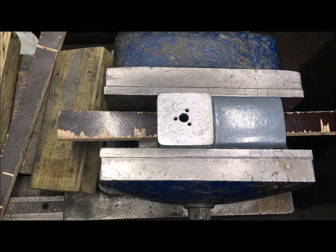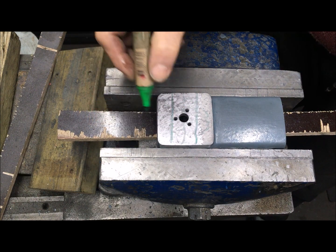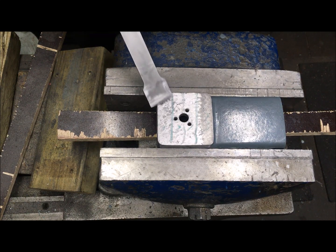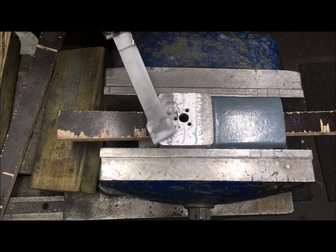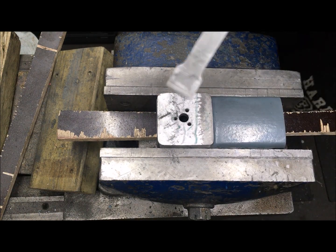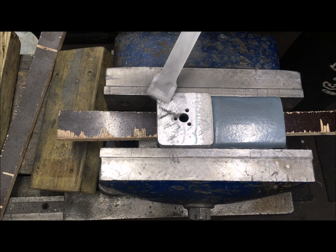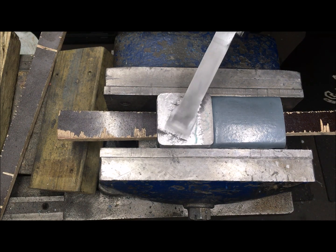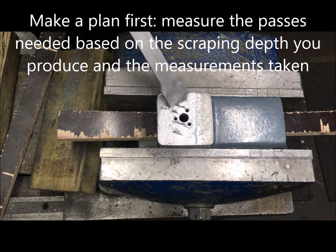Because this was a little bit high here, I'll show again: step scraping — three times, two times, one time. Let's start here; I go in circles with the biax, speeding up a little bit. This one I take from the other side like this to avoid hitting this corner, then I cross my cut and take the second one, and take this one also. Then my third cut on this side.